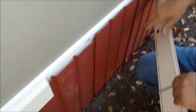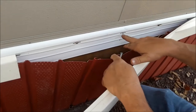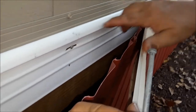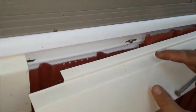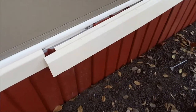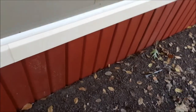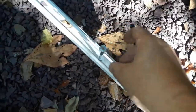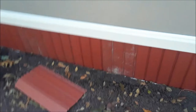It doesn't have to be an exact cut. You can put a screw in every fifth one or so. There are half-inch screws — one-eighth — to hold the upper guide in. So the nails hold the bottom track in, the screws hold the upper part, these slide in one at a time, and then you cut the top covers to fit and jam it in. Here's a closer look at the bottom track — there's the nail you'd put through and drive in. If there's no hole in the track you'll have to drill one, otherwise it'll split. So you've got the basic idea.